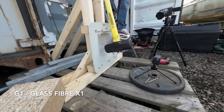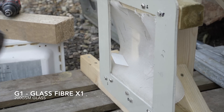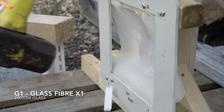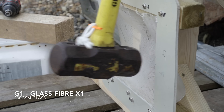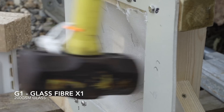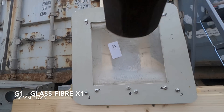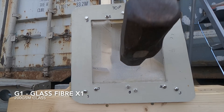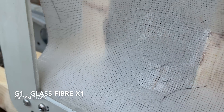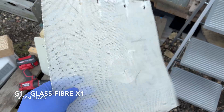I'm starting to think those added clamping positions with bolts and screws through each to keep it taut aren't enough. Instead of punching a circular hole in the glass, the whole thing is violently crumpled — the edges are ripping out, and even the label decided to part company. Those little black hairs are bristles from a cheap laminating brush used for this non-cosmetic work. Brushes are wastefully single use with these resins, so I only spend 50p on one. Single-ply glass is never going to be suitable for making anything, but I did fancy seeing a hole punched neatly through.